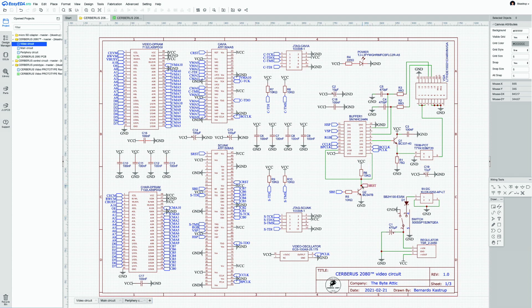What is new here is that the same signal — called Skunk Reset — is wired into pin 1 of Skunk. Skunk is programmed such that when pin 1 is high, all internal flip-flops are reset to zero. During power-up, the reset signal will be active and Skunk will be in reset mode until power-up is done. After that, SBE goes high, the transistor closes, Skunk Reset goes low, and Skunk stops resetting. This improves the robustness of the CPLD reset mechanism.